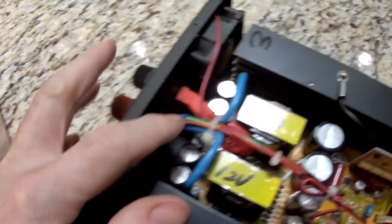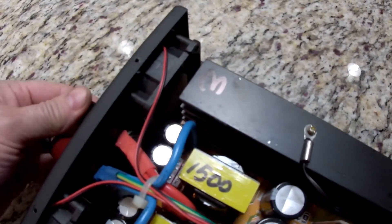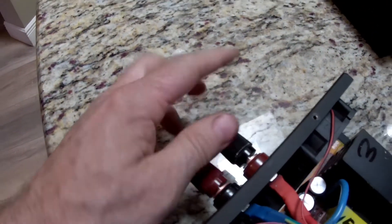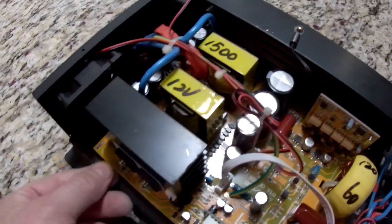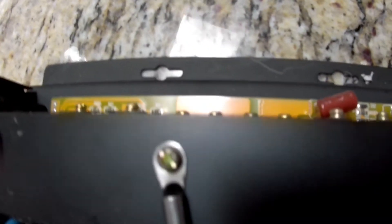You can just see the quality of this thing. Looking at the back, there are two heavy gauge wires coming off the ground and the positive. They all appear to be appropriately sized. Going right down to the board, it's a nice PC board — looks to be pretty heavy, nice heavy copper traces going over to the appropriate areas. You can see the big traces coming up to these FETs, and even on the back of the outlets, the soldering all looks clean with nice outlets.